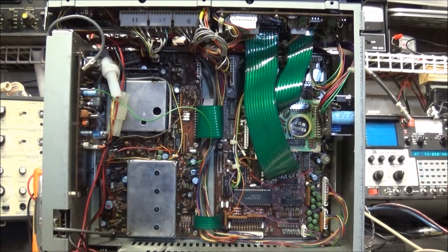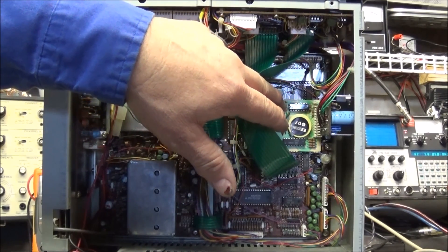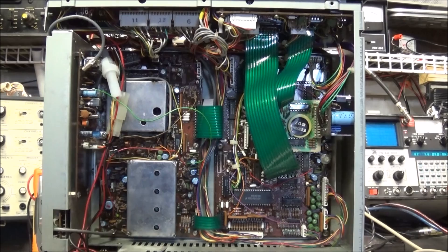There are several possibilities for fixing this. My battery is still good and still holding up, but I need to change it out. You can pull the board out temporarily, solder another battery to the back side of it, and desolder the original battery — this way it holds the program in memory. Then you can install your new battery, disconnect the second battery, and plug it back in. You should be good to go for another seven or eight years.